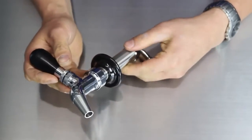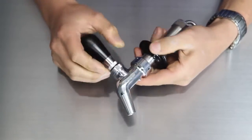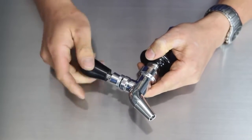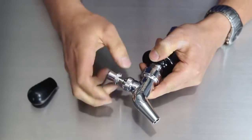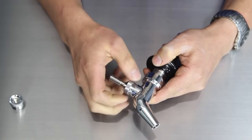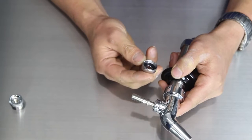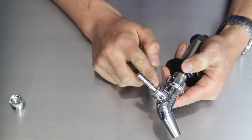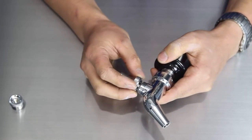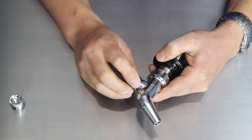The other thing to be a little bit aware of if you are installing the springs is there's a little tensioner here. You know this little nut here, so you've got this tap handle. I might actually take it apart and just quickly show you. So you take that off, you take this collet off like that, and you undo this ring. And under there you can see there's actually a little washer in there. You probably ask, why do I need that washer in there? It's not actually the main sealing component, but what it does, that washer pushes up against these components on the top of the upper ball here, and that's the tensioner.